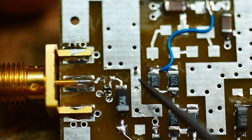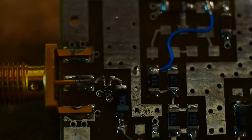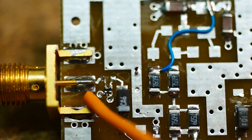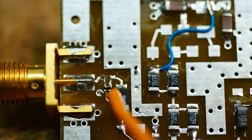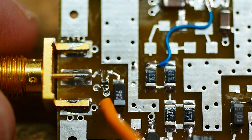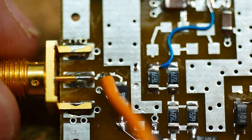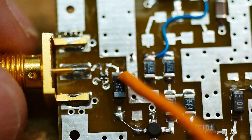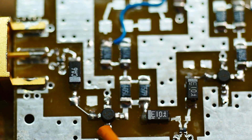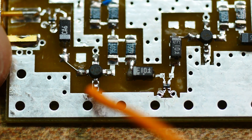The output has an additional pad — this time discrete parts: 220 ohms, 220 ohms, and a 24-ohm, which goes to the output connector. Let's get out a macro lens and see if we can see things. So here's the input connector. Using a bright orange wire as a pointer — the input comes here, and right here is a PI network pad, looks like an 0603 or similar.